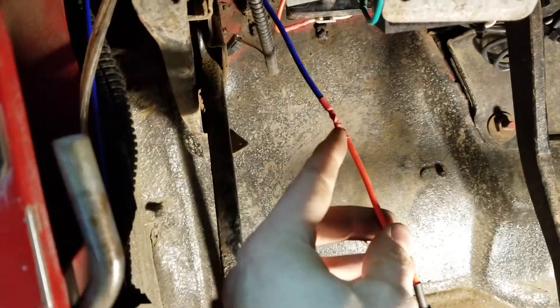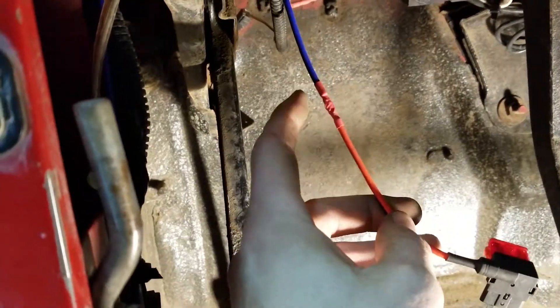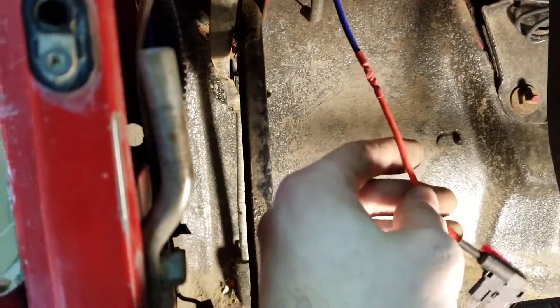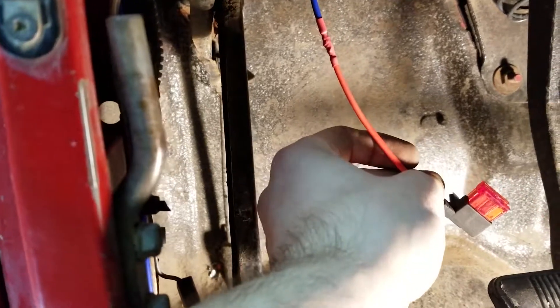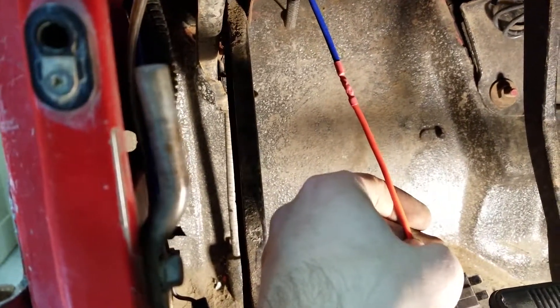You're fusing here, you've got your wire. What I did is I went in and I soldered that bad boy and put, you guessed it, heat shrink on there. And there's our friendly blue wire that we recognized from earlier going straight over to our outlet. It's really that easy — you run a wire, you stick it in your fuse block, you send the wire to your outlet, give yourself a solid ground, and you are good to go.